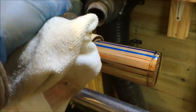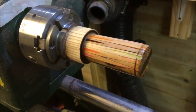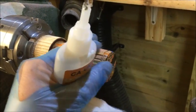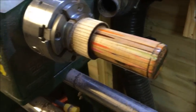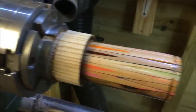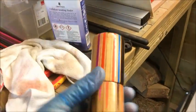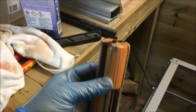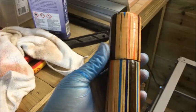I've put the base in now. I made a little jam chuck so I can sit the base in, because the chuck I've got is too big to hold this little pot — it's quite small after all that wood and all those pencils. What I'm doing here is putting some CA glue on it to try and give it a bit of a shine, which actually works quite well. Just a bit of CA glue on a cloth whilst it's turning.